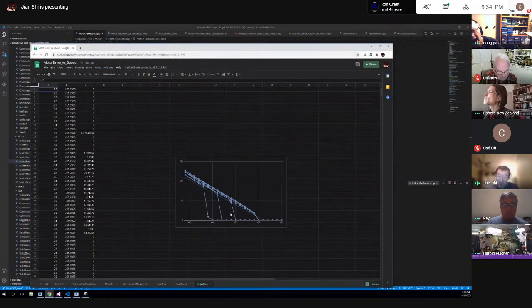I've got two motors. One is this cheap motor from Amazon, kind of a low power one, and this one, the power I can drive, I need to go up to, say, 30 something. I mean, 30 out of a total 255 full power, right? So if I go to 30 and it's a 12 volt motor, it'll start moving. But sometimes it doesn't switch until 40. I mean, when I'm driving it, I look for the starting voltage to just start it moving.